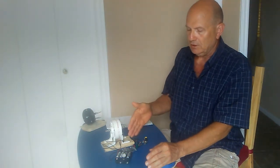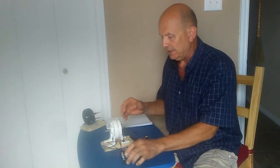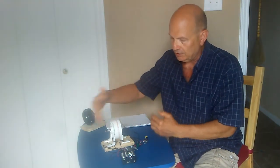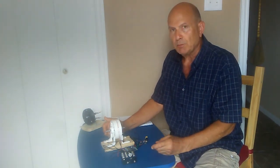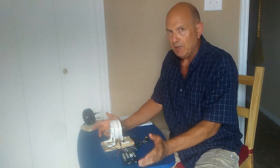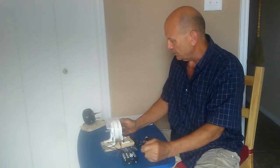Like I was saying, this is a 500 watt controller. You need to put a heat sink on the back of it, of course, to dissipate all that heat. But you could stack this sucker up until you had it drawing, what, 10 to 15 amps, somewhere in between there, but with a 36 volt power supply, you'd be running 500 watts. That is another way to improve the performance of this motor.